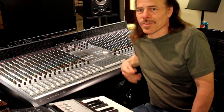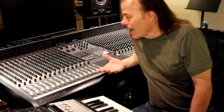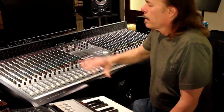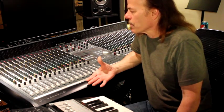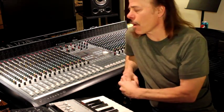Every five years you had to change every electrolytic capacitor in that console. There must have been at least 100 per channel, and it was 60 channels — that's like 6,000 caps. This Soundcraft is not quite that many; I think I changed probably a couple thousand caps in here anyway. They weren't completely gone by any means — still usable — but they start to deteriorate after about 20 years. When I replaced these caps, the main reason was I wanted to put in a higher grade cap. So all the capacitors in this console are now Nichicon Fine Gold Muse series capacitors, which are a high quality audio-specific capacitor.